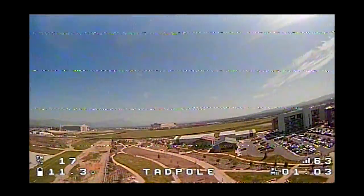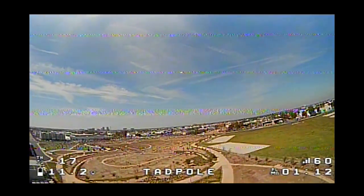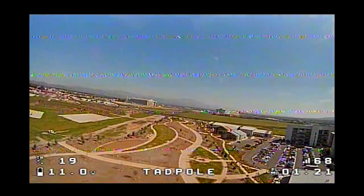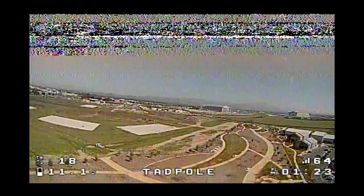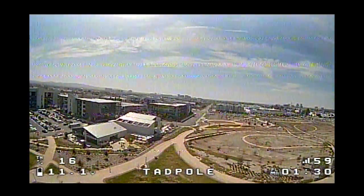Right here is about 500 meters, and that's about as far as I feel comfortable going with all the enhancements. My RSSI is in the 60s. Keep in mind that I am pointing the antenna at the drone because this is a directional antenna — something to keep in mind.